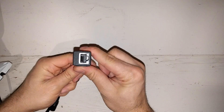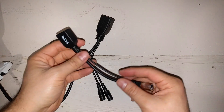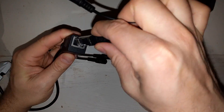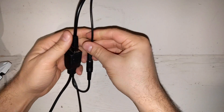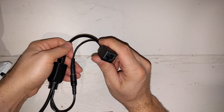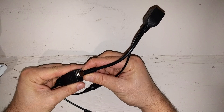Because of this, I don't want to drill a hole that's big enough to put this right through the wall. I'm also going to be using a PoE injector, so I'll have even more cables here — this will connect here and this will connect to the power. This is a PoE splitter. It takes the power and data coming from the input and splits it into 12-volt power and Ethernet for the camera.